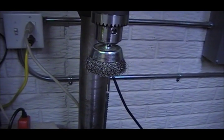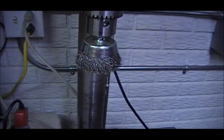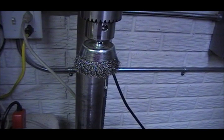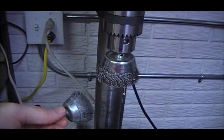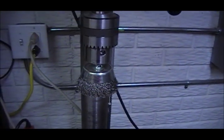The last thing that needs to be done is to take off whatever rust and rust particles are left on the metal. For this I like to use a steel wire wheel and a drill press. That's a pretty large one — my favorite to use. For anything that needs something smaller, I've got this slightly smaller steel wire wheel that can fit inside of the passenger cars for taking whatever's left off of the floors.